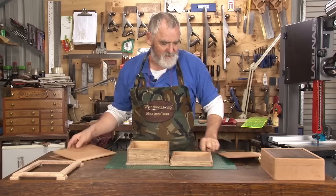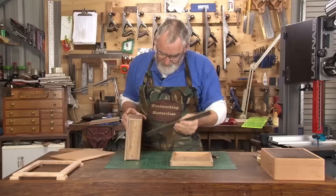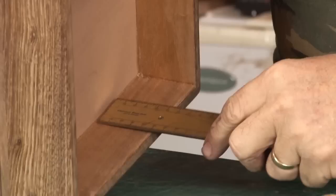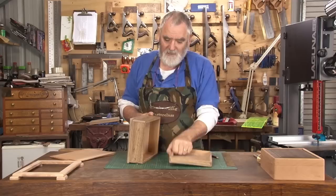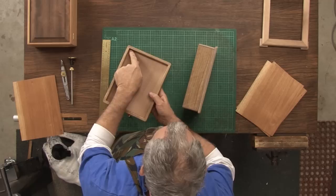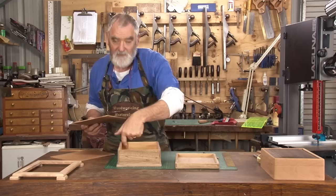Seeing this doesn't have hinges, we're going to use the infill of the box to act as the locking mechanism for the lid. So what I have to do is measure, put my glasses on so I can see, measure how deep the box is, and that's 53 mil deep. Now I want a lip of about 3 or 4 mil to protrude from that box so the lid can sit on it. And I'll also want a very, very small amount of sticking to go in there to give it a nice seal. So with my bandsaw set up, what I'll do is rip a couple of pieces to go inside here.